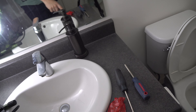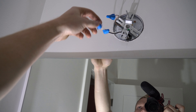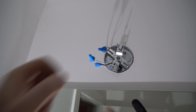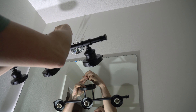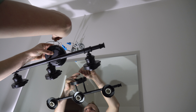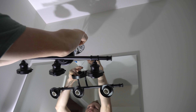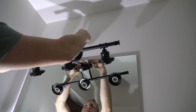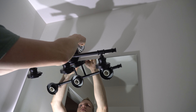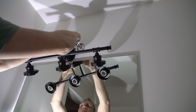After you loosen off the nubbins off the bottom, let's go bolt this plate up. This is going to sit just like that — that's your up and down right there. I'm using the same junction box screws because this is a pretty thin junction box, so I used the smaller screws that came with it. I'm also keeping these blue wire nuts rather than using the ones in the package — I just like how the blue ones have wings on them, a little easier to get your fingers around.